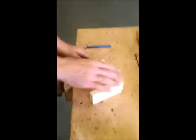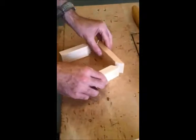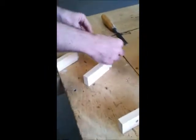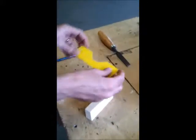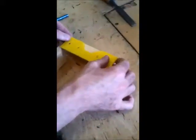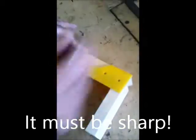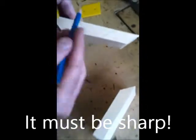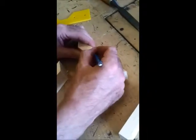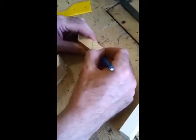We've now mitered our corners and you can see that they are ready to go together. At this stage we can start to remove the wood. We can use our template again in the middle and make sure this is central. We can take our pencil and just mark where we are going to cut. The middle part is going to be wasted away, so we are going to use hatched lines to mark the waste.